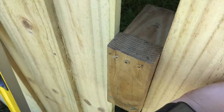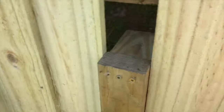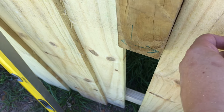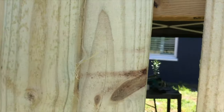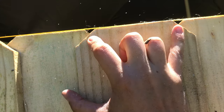I'll move this down to the second 2x4 here and make sure the board butts up against it. Now for the board that goes in between — basically all we're doing to get it in the right spot is looking at the triangles. Triangle here and here — we want it to be even, that's how we know it's in the middle. Then line it up to the string line.